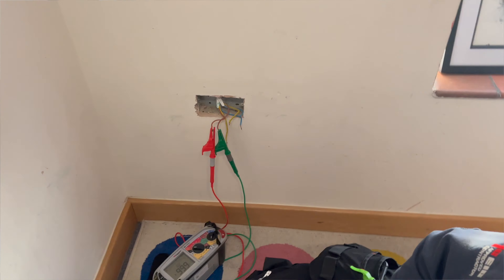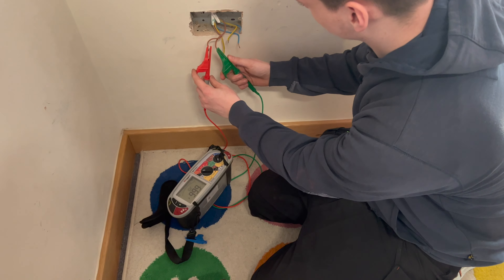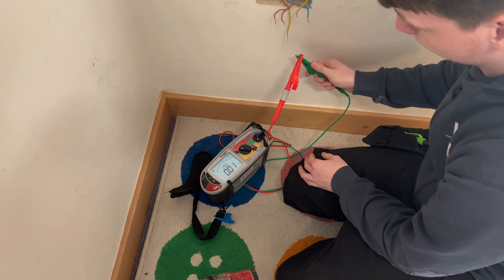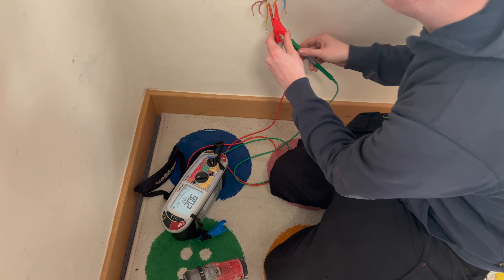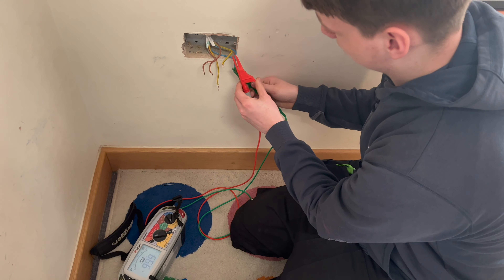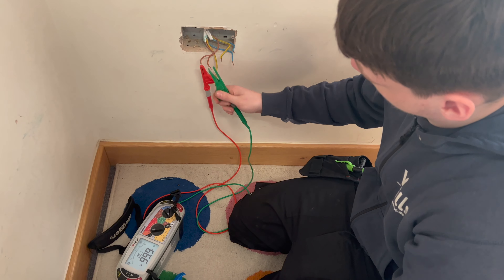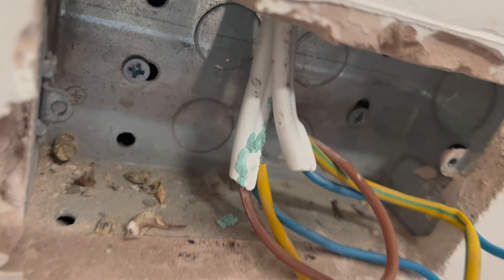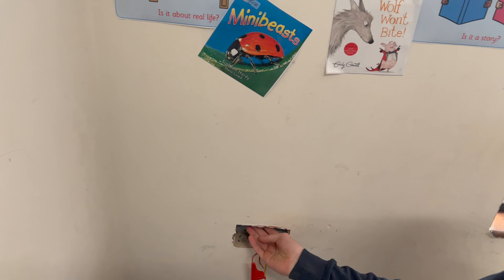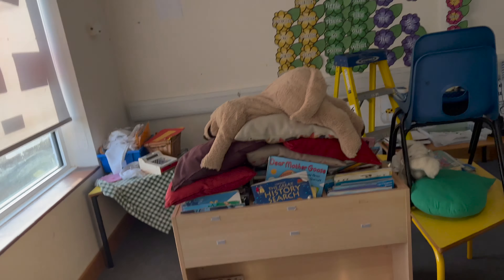Let's crack on — just talk us through what you're doing, Ebbs. So basically just doing the end-to-end on the live — I've got nothing. Put the leads back together just so we can see what's going on — they've been nulled out. There's nothing on the live, so that's obviously popped out somewhere. It's on the conduit as well — this is the old classroom, they must have probably pulled down the ceiling.